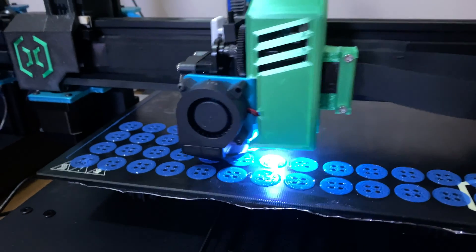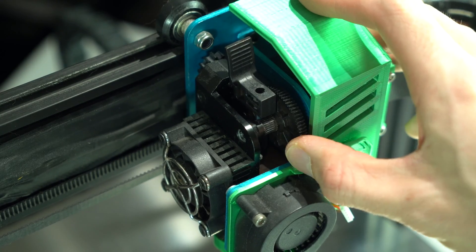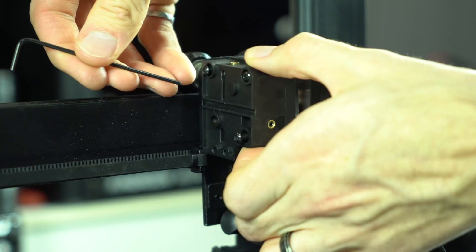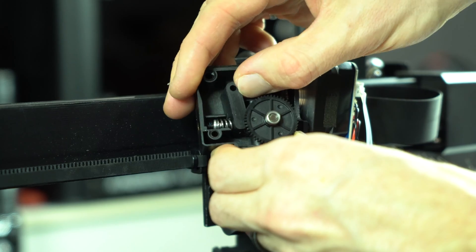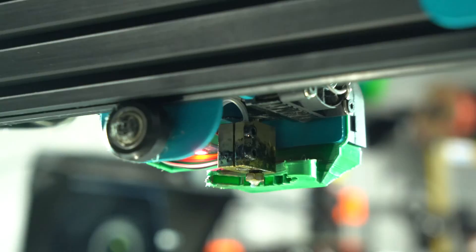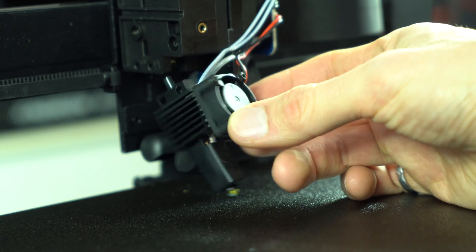The X1 and X2 had a clone E3D Titan extruder with a single drive gear and an exposed idler arm with tension hand-adjustable via a knob. The X3 has a dual-gear direct drive extruder. The entire unit is enclosed, with tension adjustment now requiring a hex wrench. The familiar volcano-style heat block of the X1 is replaced by something more akin to the Bambu hotend — unlike the Bambu, however, the X3 nozzle is removable.